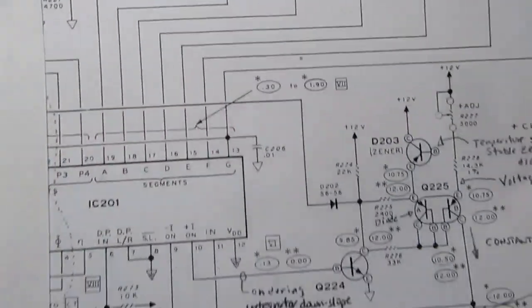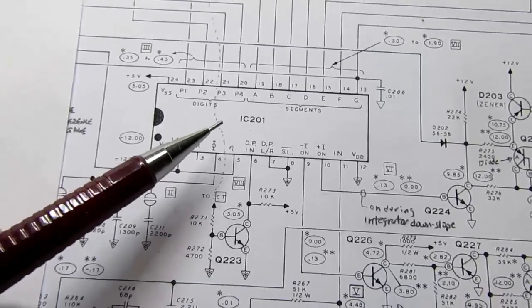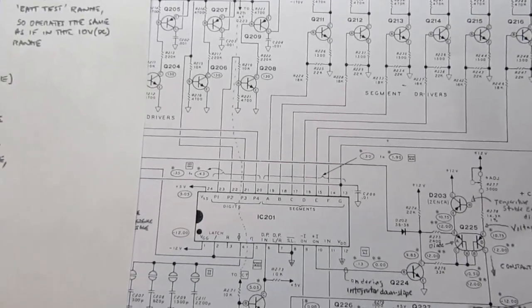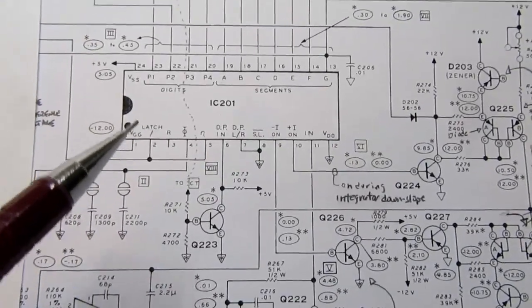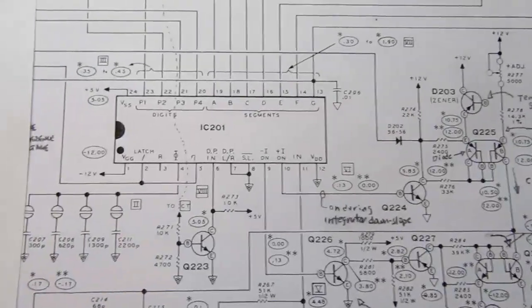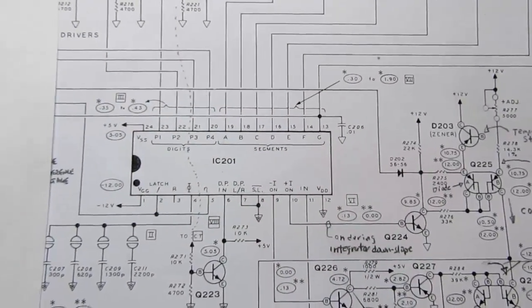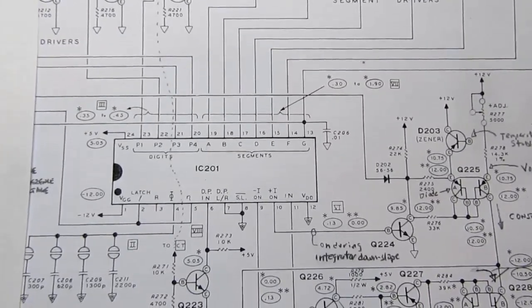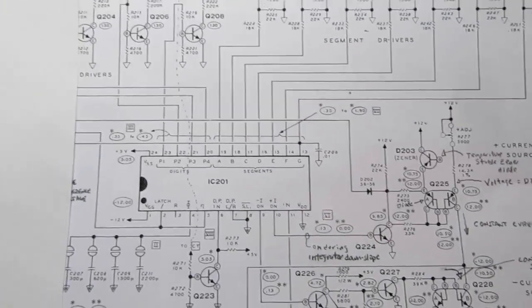And also the integrated voltmeter chip, IC-201, that's that MOSTEC part, between it and some of the support circuitry, it can be told or forced into a mode where it disables its internal counter latch functionality. So the way these chips all work is they have an internal counter and a comparator, and there's a slope, or a voltage that charges up on a linear slope, and you wait till the voltage charges up to equal the input voltage that you're measuring. At that point it'll stop the counter, and whatever has counted up is a numerical value equal to the voltage or whatever you're reading, and then that gets latched and then displayed, and then the whole cycle starts over again with a new slope and so on.